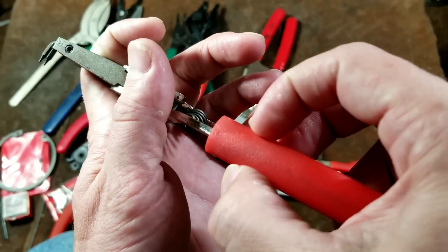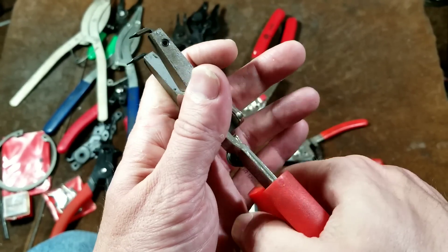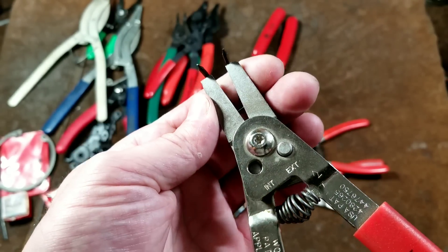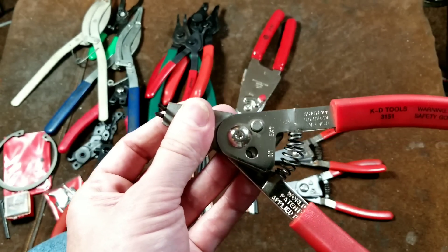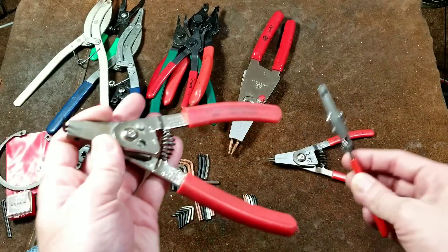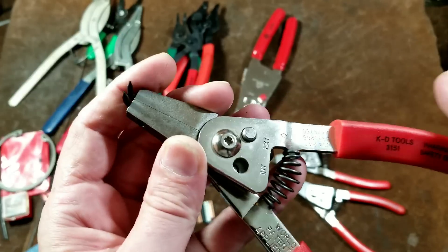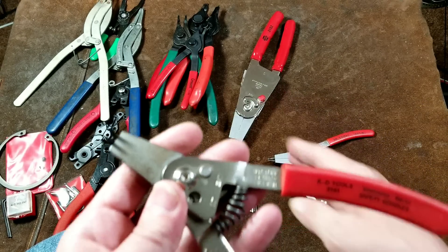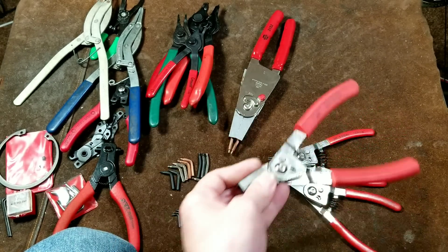The mid-sized ones are just the same as the small ones. The only real difference is that they come with a solid, wider, over-molded handle so you don't pinch your hands quite as easily. I wish they would have done that on the little ones, particularly given how much they charge for these things. They're absolutely the exact same design otherwise. Even though the medium size is significantly larger than the small ones, they use the same size tips — and I've had a couple of situations where I was using these on a snap ring where I should have been using the larger ones and I snapped the tips off. Fortunately, they're pretty easy to replace.